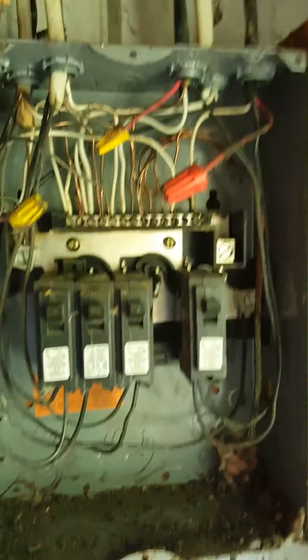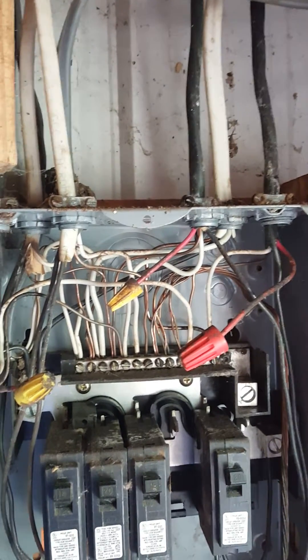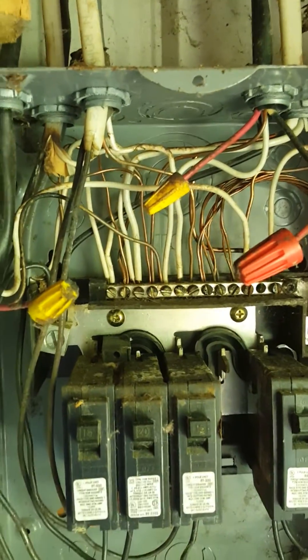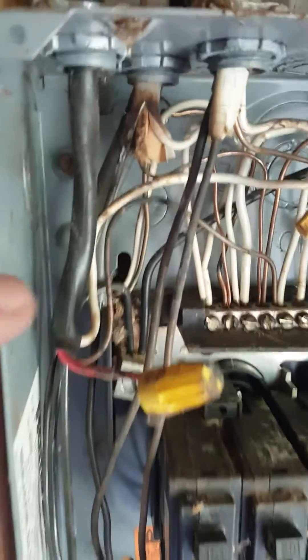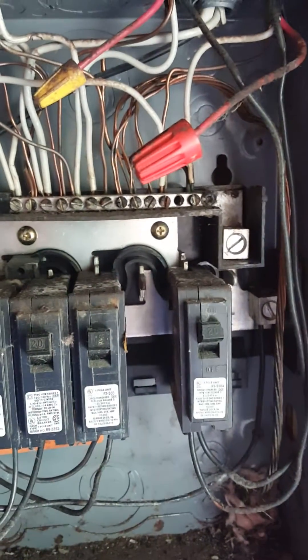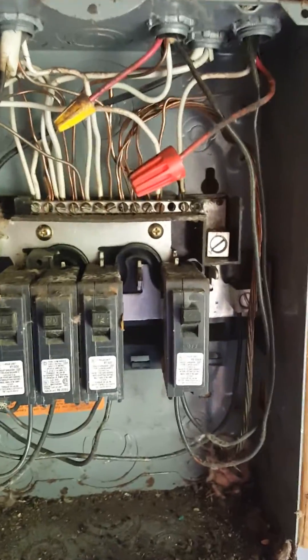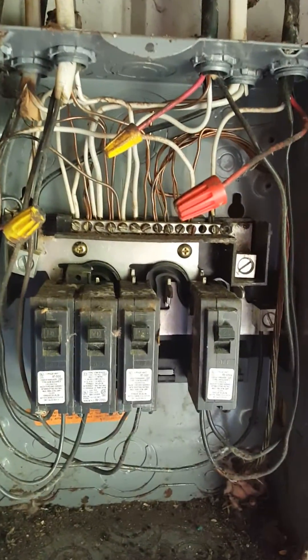It's bad. The main line coming in goes directly to the house — I think it's directly buried underground at some point — and it connects to a 20-amp breaker with 12/2 wire. So there's only two wires: a hot and a neutral underground. The hot wire — this black wire in the back — comes around and hooks to the bus. There's another wire coming out of that bus; it's a jumper that hooks down below and connects to the other side of the bus, effectively making this appear to be a 240-volt circuit, but it's really 120 volts with a jumper. All they did was energize both sides of the bus bar with the same line, when typically bus bars are on two different hots at 120 volts each. That's a problem.